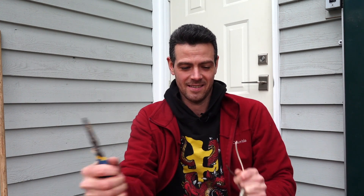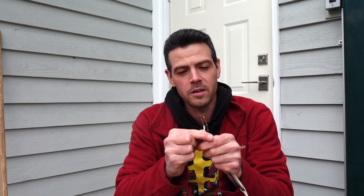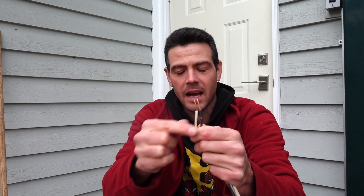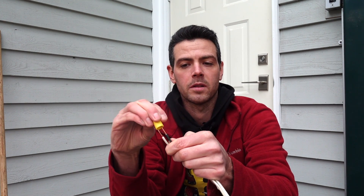The next thing you're going to need is a wire stripper — this is another Klein one. I like Klein tools. When you're putting your wires together, it's not so much about making sure the ends are lined up — it's about making sure the sleeves are lined up. If one wire is a little shorter and you line up the ends, there's a higher chance some copper is going to be showing at the end. So line up your sleeves, then put the wire nut on. It doesn't take a lot of force to get it going at first.